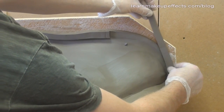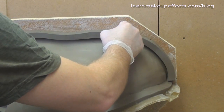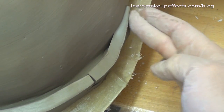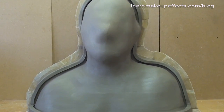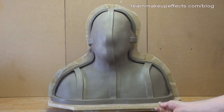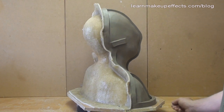Once the surface is smooth, I place half inch square strips of clay on top of the edge, pressing them firmly to make them stick. Fill any gaps as you go to create a neat low wall all the way around the edge — this will act as a key to locate the silicone in its jacket later. I then place a few larger keys on the head itself to help the silicone locate better, keeping it simple since you'll have to fiberglass over all of it.